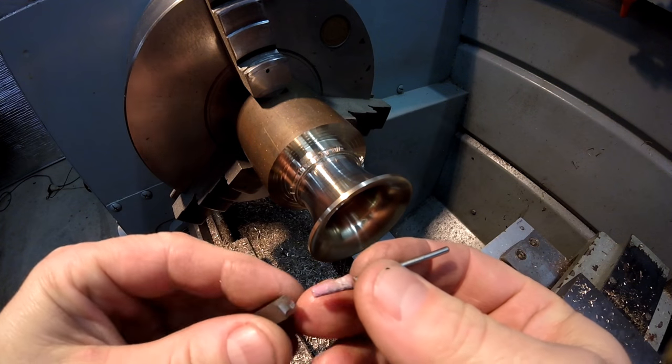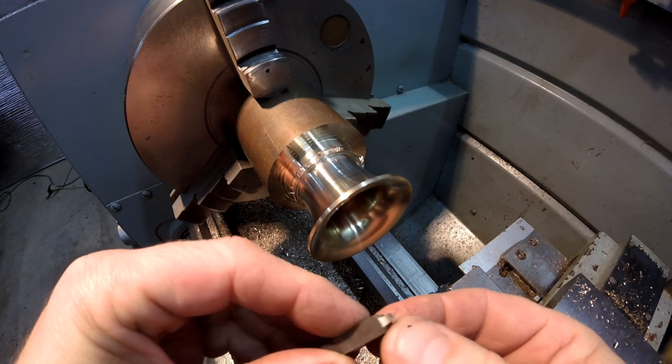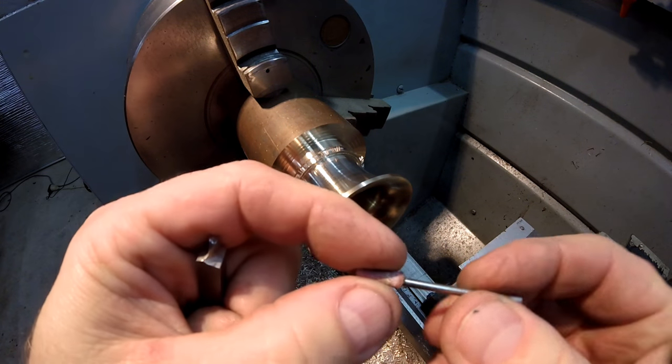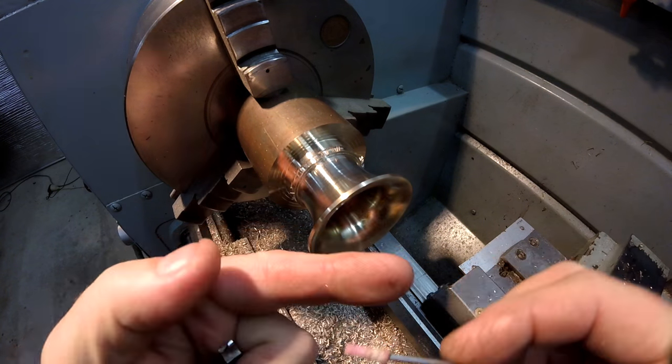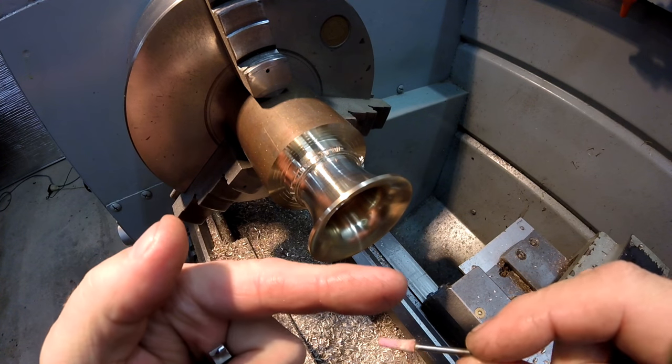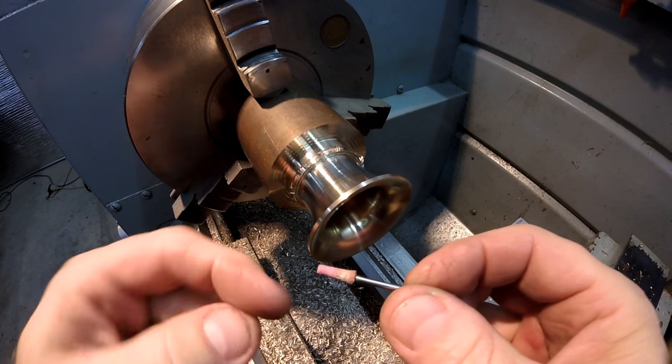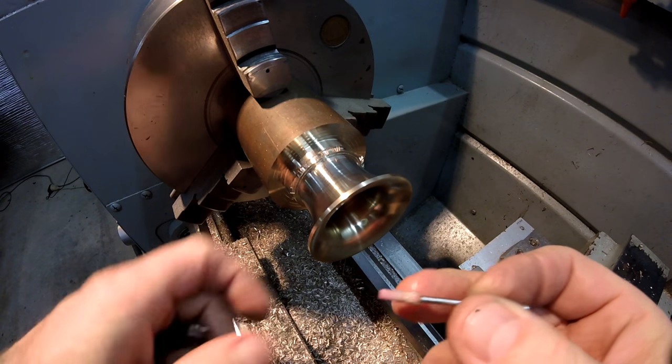We've all seen them. Now, I'll take a form tool or a tool that already exists, and I'll go over to the bench grinder with the Dremel running as well, and I'll use the bench grinder to dress the stone to the diameter that I want, and I leave a taper, always leave a taper.